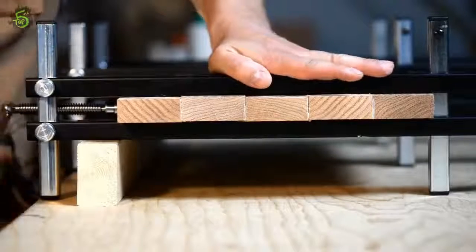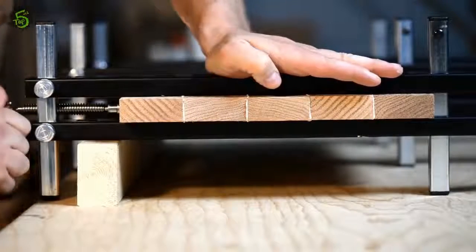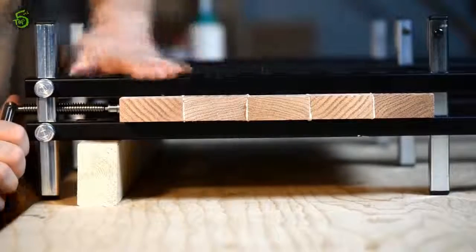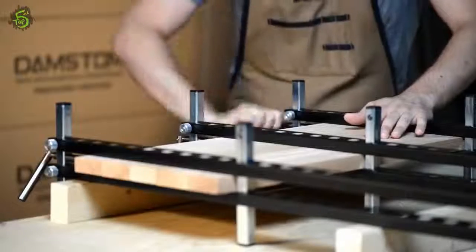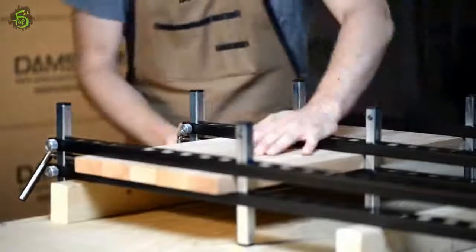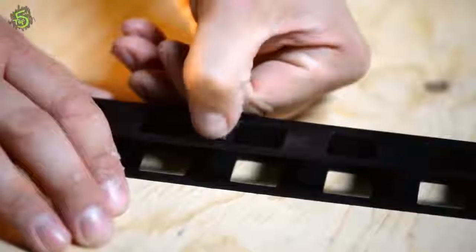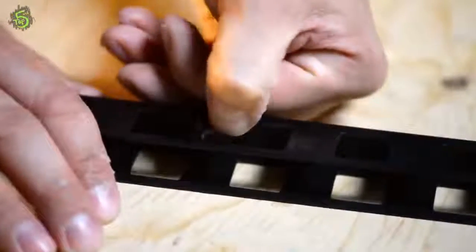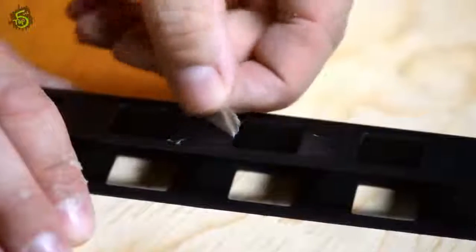Since each clamp prevents panels from popping up, you can space them between 12 to 18 inches apart, much more than conventional clamps. You will need fewer clamps, and since they weigh just 4.6 pounds, you can move the panels out of the way easily. No cleaning problem either. With its electrostatic paint finish, glue won't stain the wood, and you can even peel it off with your fingernail. Simplify your wood panel glue-up.